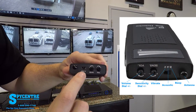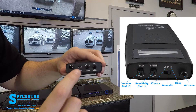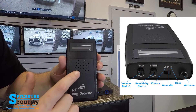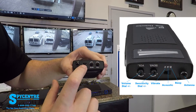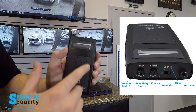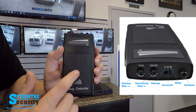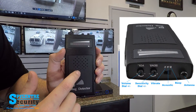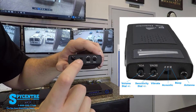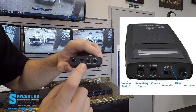The next setting is A as in Alpha, for audio verification. This is an auto tuner — it will play what a bug is hearing through the speaker on the front of the device. All you do is turn it to A, power the device on, and walk around your home or business. If you hear yourself coming through the speaker, you've positively identified that there's a bug, and then you can do an RF sweep after that. Lastly, you have V for Victor — this is a vibrate mode, so instead of beeping at you, it can vibrate to indicate when you're close by.